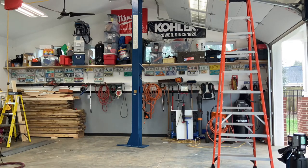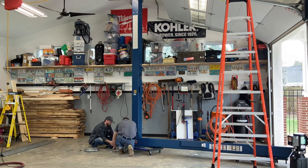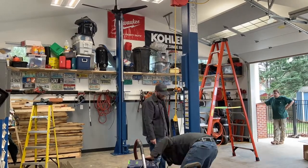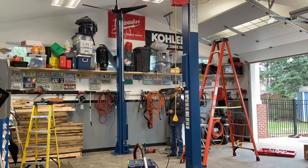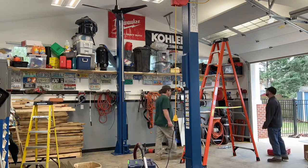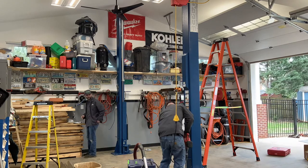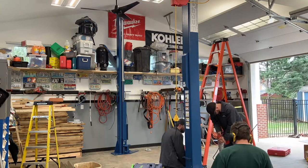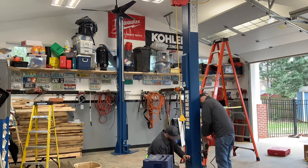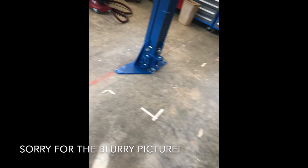With post number one up, it comes to post number two. As we start to line up that second post, what becomes obvious is the post is going to be sitting on an expansion joint for the concrete, which is not acceptable. We looked at it and tried to figure out if there were ways we could possibly move the post slightly to the right or left, but the problem was then the post would not be lined up with the door. When you would bring in a vehicle, it essentially would not be correct and very challenging. Here you can see the foot of the post and how it lines up almost directly on the expansion joint.